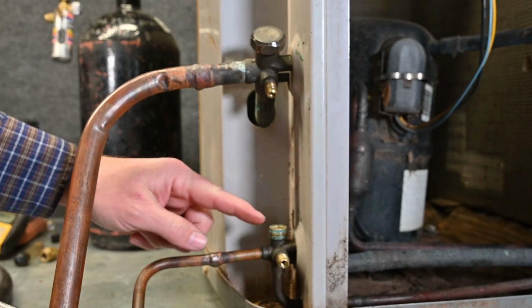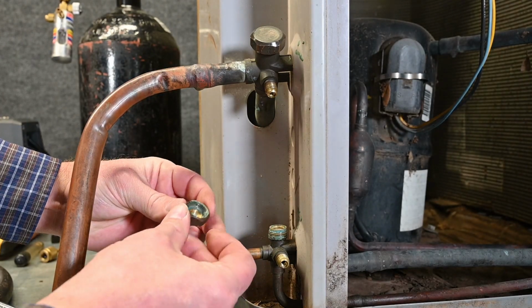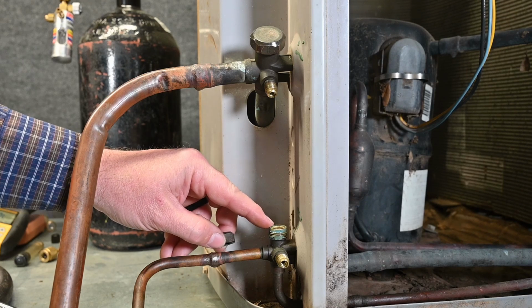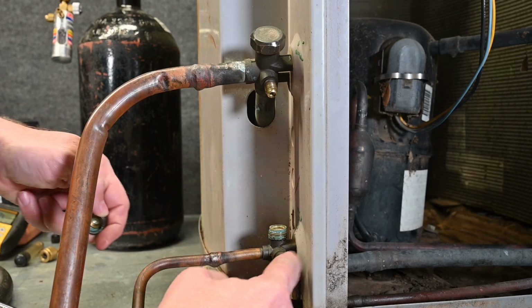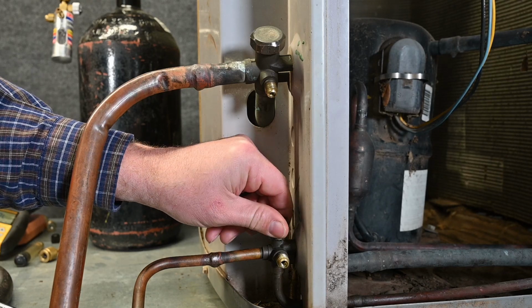We have the same thing here. We make sure that this valve is all the way up. It's almost flush with the top, which is what we want. We can see the corrosion from before. We can't help that. But also put the nylog in here already from last time. And since the cap's all the way up, we're pulling all the way from the entire system. And again, if it was pumped down, this valve would be closed all the way down. Their service port would be reading on this side of the line. Make sure the cap is on there all the way.